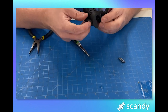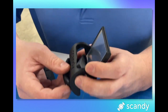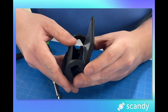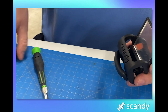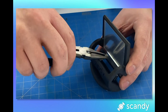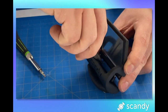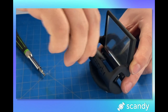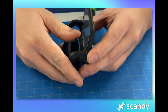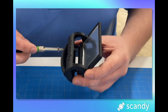Step 5: orient the paddle over the covered screws inside the body so that the prongs are facing towards the screws. Step 6: using the needle nose pliers, seat the compression springs on the prongs and into the small holes next to the screws. Step 7: use an allen wrench or hex head screwdriver to tighten the screws on the loop until the ends of the screws are flush with the top of the paddle.